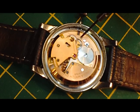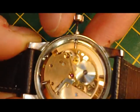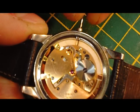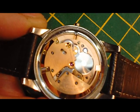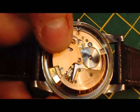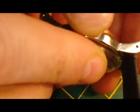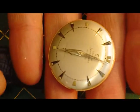I've already loosened that just about a turn and a half. The winding stem, which once free, should just slide out like so. Then the whole movement, now with that retaining clip removed and the stem out, will gently drop out from the case. I'm going to remove the hands now.